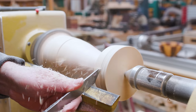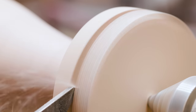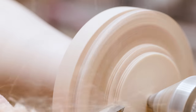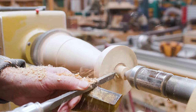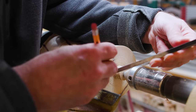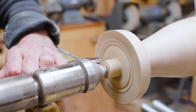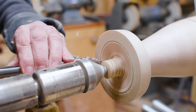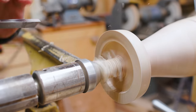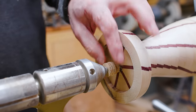Then I could clean the plywood off the top. I cut another deep mark with the parting tool at the seam between the maple and the plywood, then just carved off the plywood from the top. I measured the wide candle that I want to put in this and marked where I need to cut for that. I'm going to make a little pocket for the candle to sit in — I can start to carve away some of that material while it's still on the tailstock and get the last bit of plywood off. The center has a void in it so I don't have to go all the way through to get the plywood off.